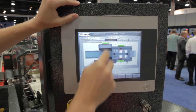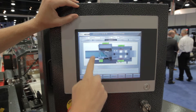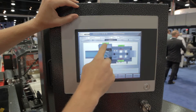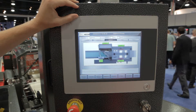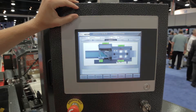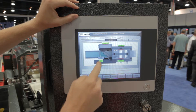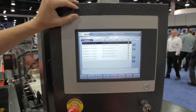Over here in the safety overview you have a top-down view of the machine with all the potential safety zones. You've got an e-stop right here and on each one of these doors you have a sensor as well as the film feeder. If you were to open one of the doors or hit the e-stop it would turn red and generate an alarm that would show up in this list.